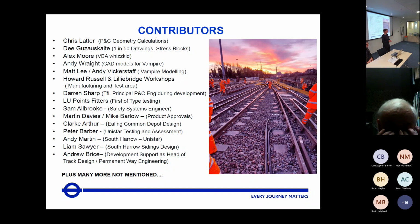Generally they're all 1435s. It was just because we'd introduced the additional gauge widening to 1438 on those. Were they fabricated crossings or cast? So we have put some as fabricated, but ultimately I think on the West End we had more fabricated than semi welded. On the East End I think they were virtually all semi welded in the end. So, thank you.